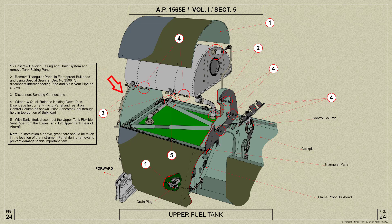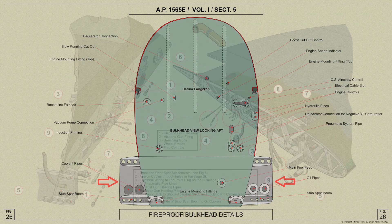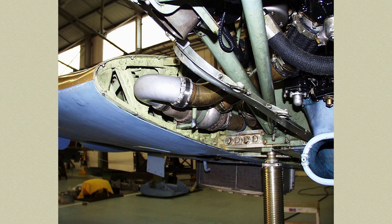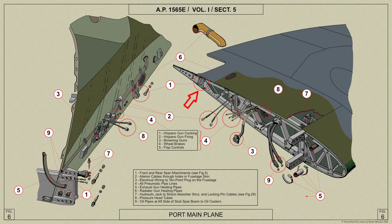The fireproof bulkhead is attached to frame 5, which in turn is attached to the forward ends of the longerons. The frame carries 4 channel section members extending across the bottom of the fuselage, forming booms for the attachment of the main plane spars. Plate webs are secured to these booms which extend beyond the fuselage sides, with 3 holes drilled in the top boom and 4 in the bottom for the plane attachment bolts. Two hemispherical jacking pads are bolted to the bottom boom. The auxiliary spars of the main plane are attached to brackets on the outside of the fuselage at the bottom of frame 10.